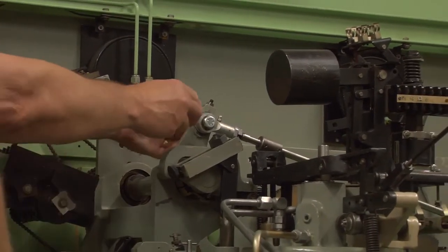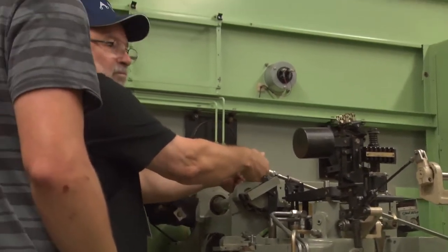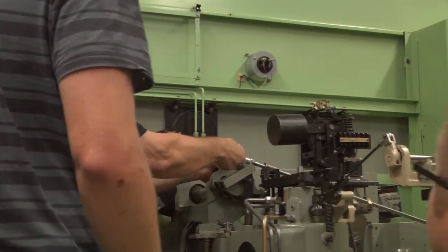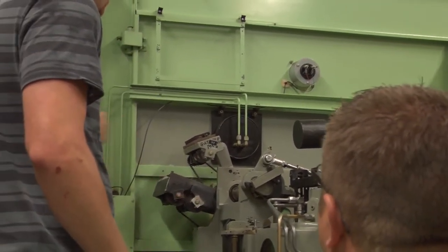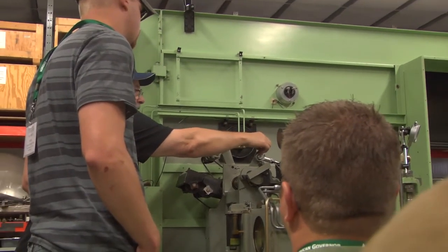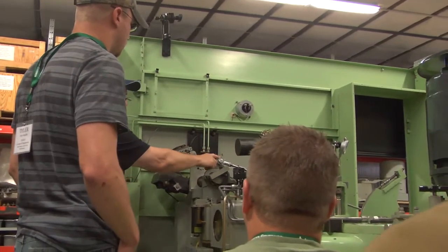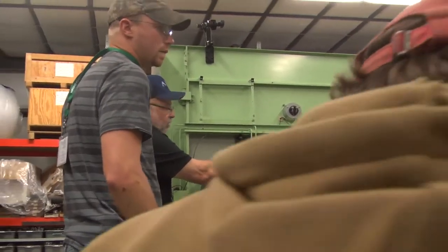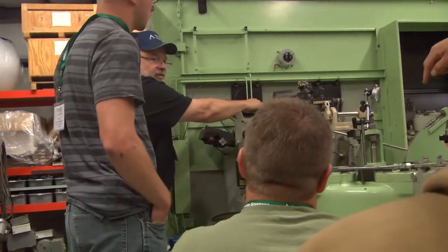Okay, so you loosen a little bit here, pop it up there, and put the eccentric. Basically, we didn't touch this part very much. That's not really an eccentric though, is it, Mike? It's just a slot. Slotted hole. And then for your fine adjustment, you take that set screw and drive it.